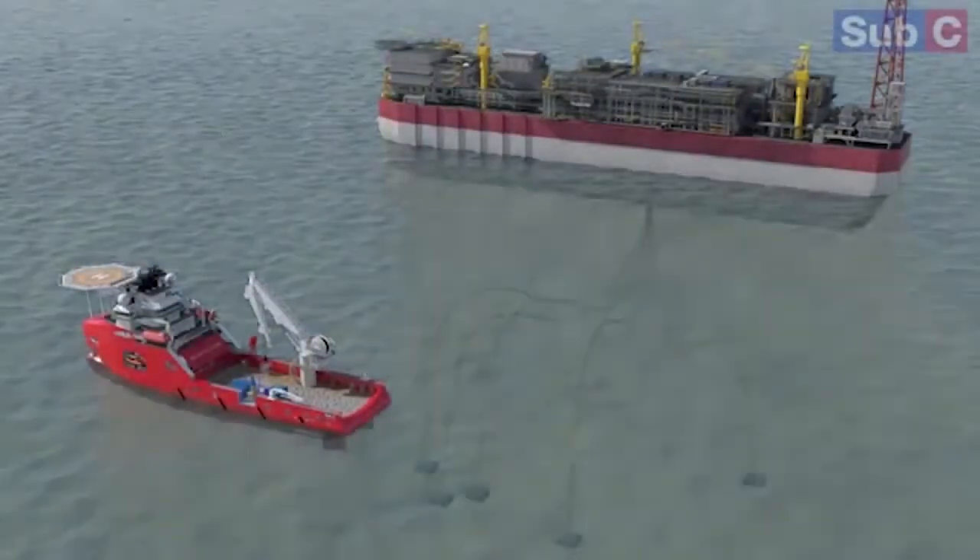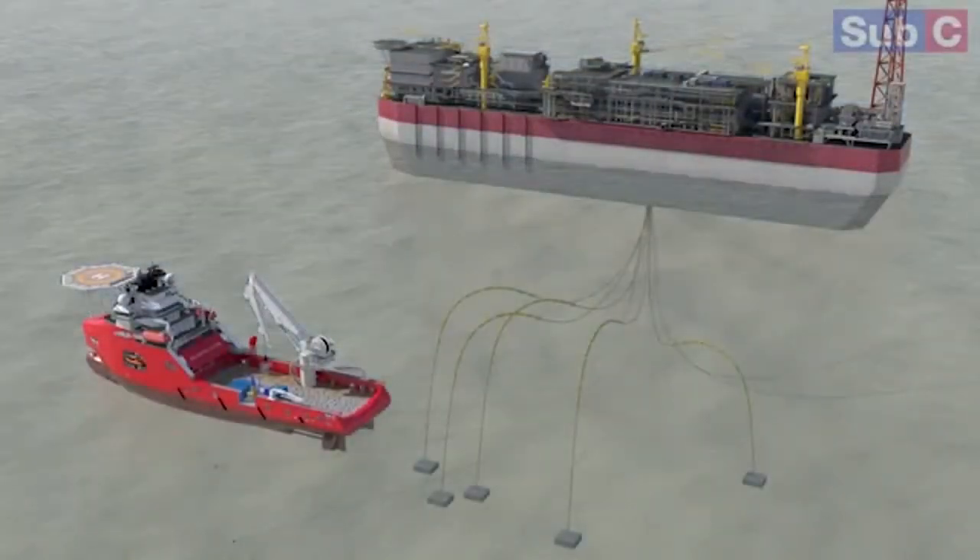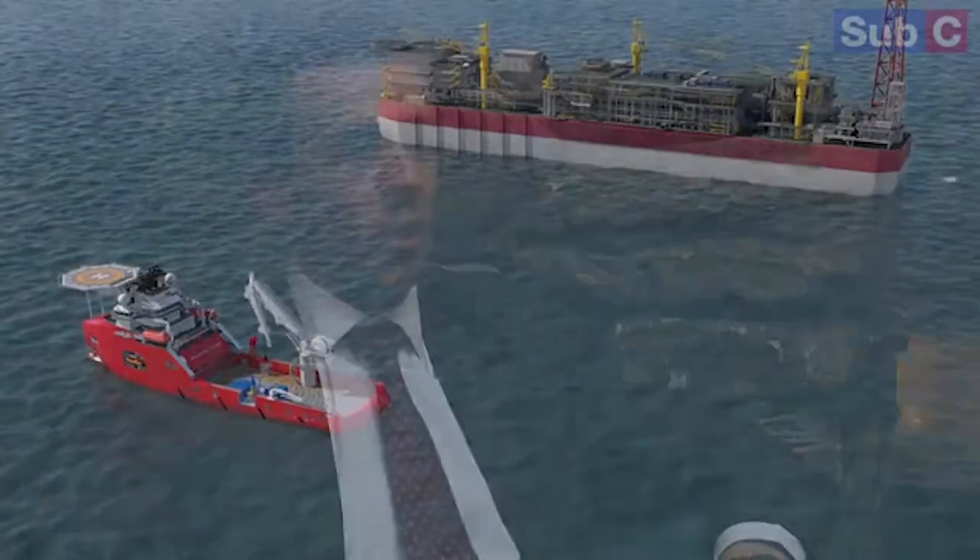On GP3 over the last couple of years we've seen buoyancy modules on the risers slipping over time. We need to rectify this because if we allow them to keep slipping, the riser will be compromised and we don't want any kind of failure of the riser systems.